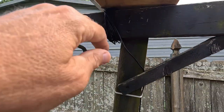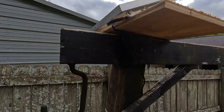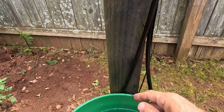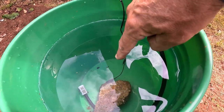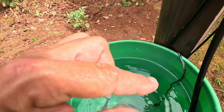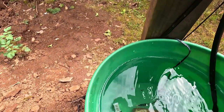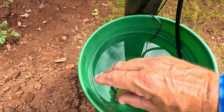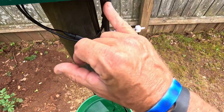There's one wire that comes out and goes up to the solar panel. The sun rises over there, so I have it maximizing sun exposure. For the water level sensor wire, you want it to hang — you don't want it sitting completely on the bottom. I have one all the way on the bottom and one about an inch off. Then this second intake hose runs down with a filter on the end. I put a little rock on it because it kept floating up — it's just barely holding it in place so it vacuums in water, sucks it into the pump, and sends it out.